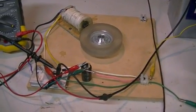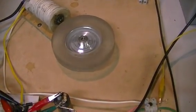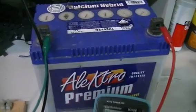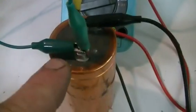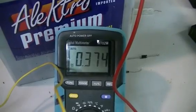In this test we're going to do an on-the-fly test and see if a spinning rotor with magnets adds any efficiency to a pulse system in regards to the flyback. We're running off of our 12 volt battery. This meter here is reading our current, and that meter is between the battery and a big filter cap — 10,000 µF, 63 volts, high current cap — giving us a very smooth and stable current reading. So that is our power in.